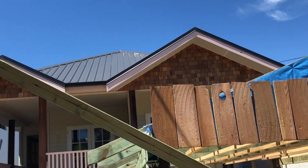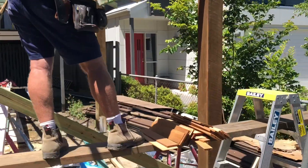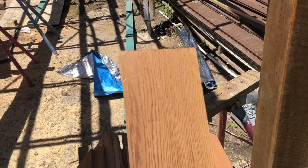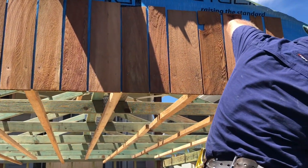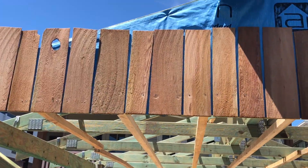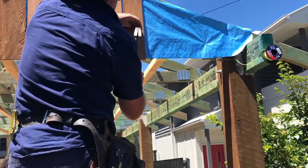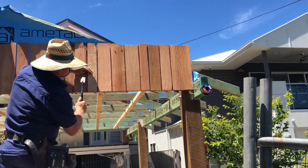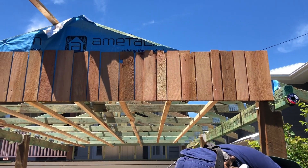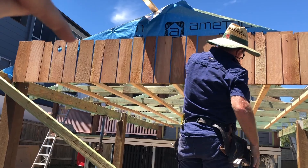You can see one of the finished gables up there. We're now putting shingles on this carport — it's western red cedar shingles. They come in little boards, roughly 400 mil by 60 to 80 mil, in random sizes. Randall is nailing them up, leaving a gap for expansion so you don't see the blue house wrap behind — we do a double layer for the first row. He's run a string line to keep the bottom edge straight, overlapping so the house wrap is hidden. Each subsequent row goes about 100 mil higher.